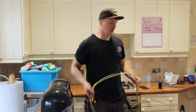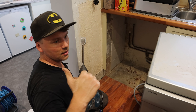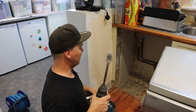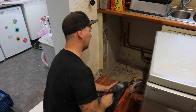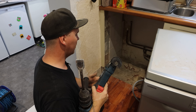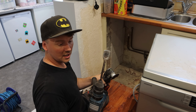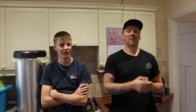We've just pushed the washing machine back. The idea is we've brought the cables up there and we're going to bring a boiler feed because the boiler is literally on the outer wall, and then the mains water bonding as well. We were going to pull this out and cut a square to bring the cables up, but what we found here is tiles and concrete - so the raised floor must end somewhere here. We're just going to cut a square out - this floor is all getting ripped out anyway. We'll cut a square back and see if we can find it. If not, we might have to feed under the plinth.